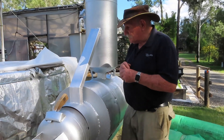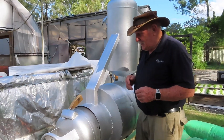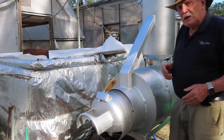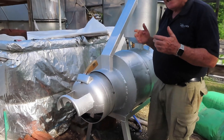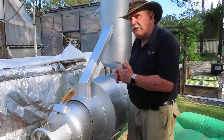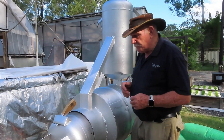We're very very pleased. We fired it up yesterday before we did this modification, and we got the water temperature in the heating hot water tanks - there's two 1000-litre IBCs, that's 500 gallons of water altogether - up to 88 degrees C, which is very close to boiling point, with a small fire running for about eight to nine hours.